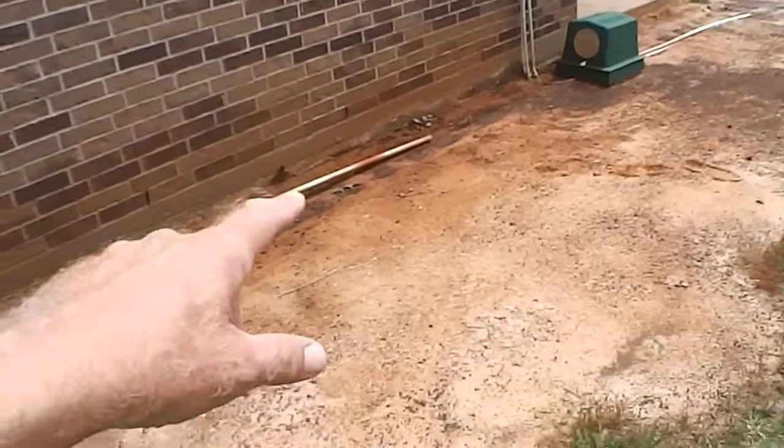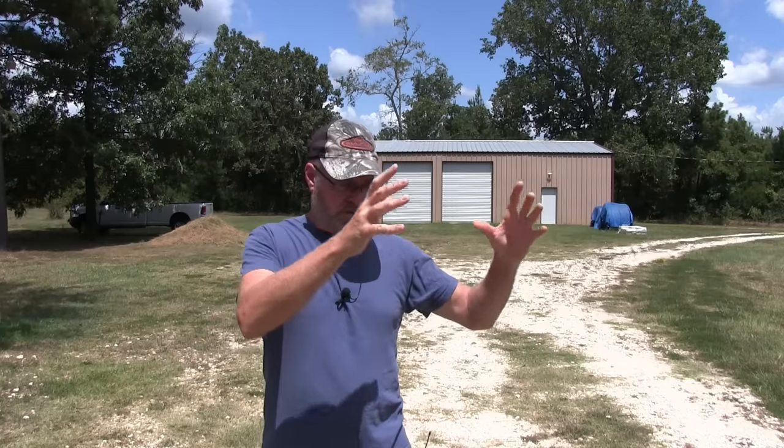Anyways, I solved the problem by dumping the discharge into the clean side of my septic tank. I have an aerobic septic system. Not the drain field type. You don't want to do this to the drain field type. But the aerobic system is where you have your trash tank, then another middle tank where the bacteria gets aerated, and then you get your clean side where that gets sprayed onto your lawn. Well, I dumped that onto the clean side of the tank, where it gets diluted by, I don't know, 1,500 gallons of water, whatever it is, and then it gets sprayed onto my lawn, and I haven't had any problems since then.